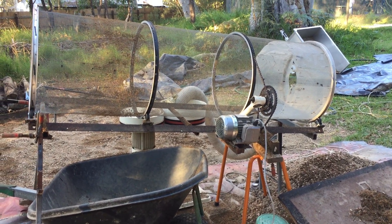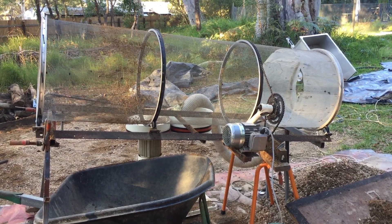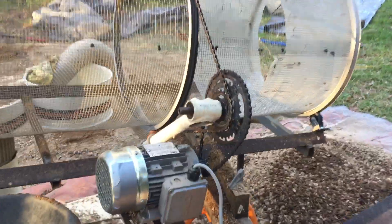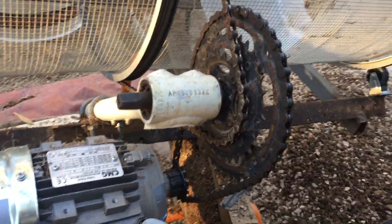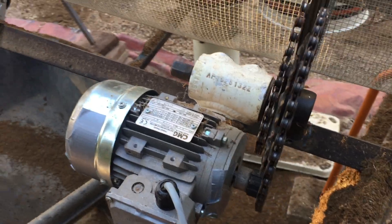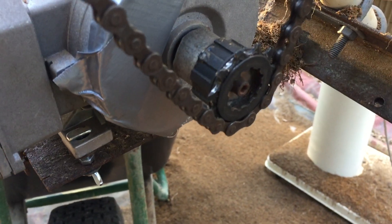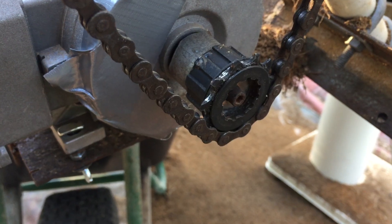This is my sand, gravel, and roots separator made from four mountain bike wheels. It's using the front sprockets from a bicycle motor — the smallest sprocket off the rear cassette. It runs a bit fast; I would gear it down a little more, but I have the advantage of a frequency controller in that box. That's another part of the invention, though I should mention it's not my invention — I just built it.